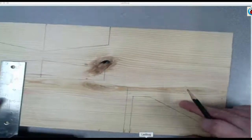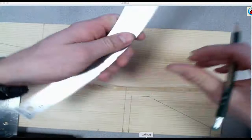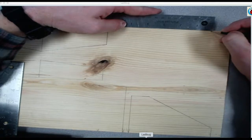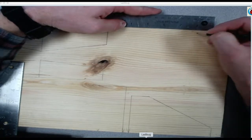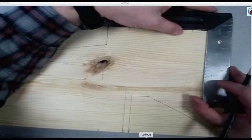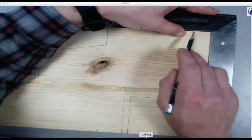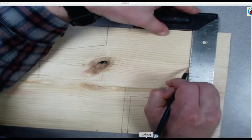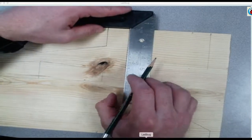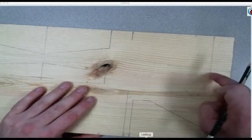And then I'm going to mirror this around and put another one up here. So I'll hold my ruler on the edge — equal space on both sides — I'm going to make a mark at zero, one and one eighth, and five. Take my square, make a mark from zero to three and one fourth. Slide over to the next one, just make a dot at three and one fourth. Slide over to the next one, line from zero to three fourths. Connect A to B to C.